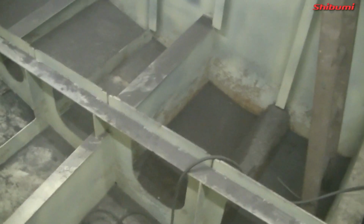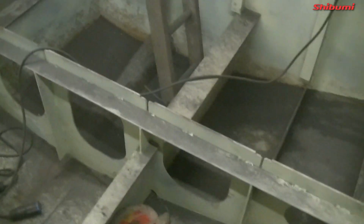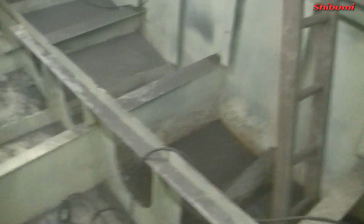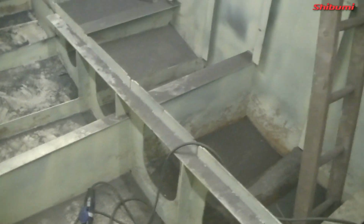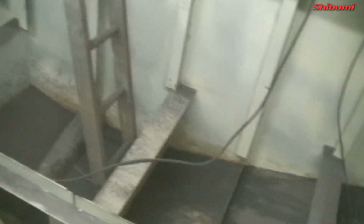And those little strips, that strip will continue on back over there again once the tanks are in, or at least the sides of the tanks are in. And of course I have the other side done, and I have that side done. I don't have anything to do in there because the top of the tank is actually going to be welded to those top seams, and I can actually get at all of those. They're up high enough to make sure they're fully welded, so I'll re-weld the inside seams of those and then weld the top to it and take out those bits of angle.